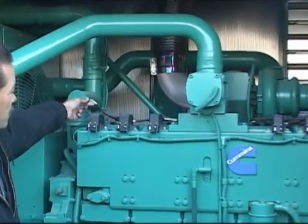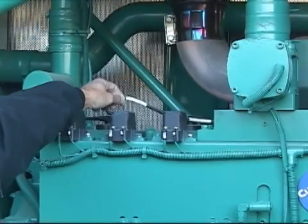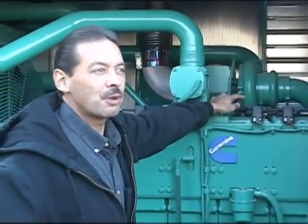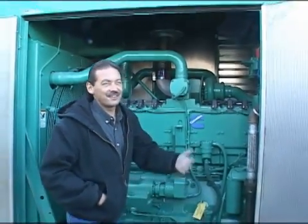This is a natural gas generator — it does have spark plug wires. I don't know if rodents or squirrels are a problem here, but they like to chew on the silicone wire for some reason. You guys might always want to make sure you check the spark plug wires. We've found them where there's just nothing but the carbon core left — it's something about the material they like.